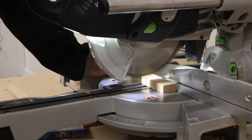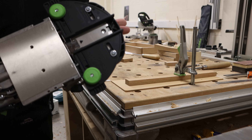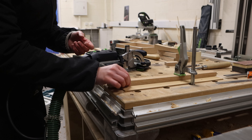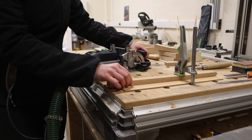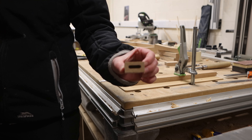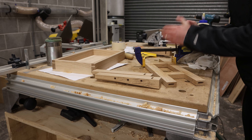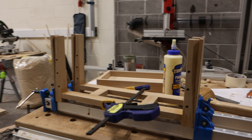I've finally got everything done. I've got them to be as symmetrical as I can — obviously this is by hand so there are going to be slight differences, but I'm happy with the spokeshave work. I've got my fence set up so it centres every single time, and I've offset my piece so that it sits off the workbench. These are the same thickness so I can reference off both of them, which makes it safe to put a domino in this little piece.